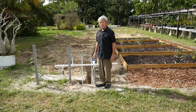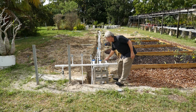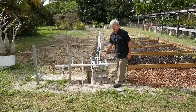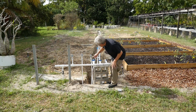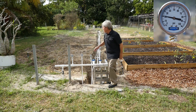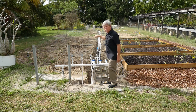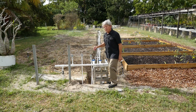First, in an earlier presentation we observed that in using 100 feet of three-quarters inch supply line there was poor irrigation coverage. There was only 21 pounds per square inch pressure in this three-quarters inch pipe, and that's not enough for the particular sprinkler heads at this particular spacing for good coverage.